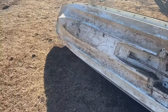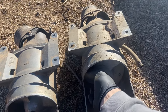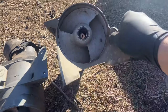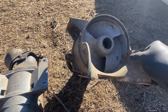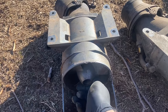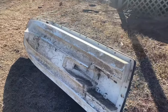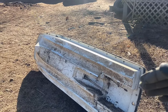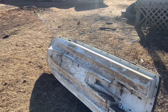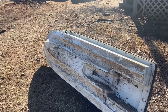We just got the pump pulled, and as you can see, this one is completely locked up. Not really sure what happened — probably got some water under the wear ring and it just swelled up, which is common with these 650 pumps. Thankfully we do have a spare TS650 pump and it should bolt right in, which is super nice. Now we're going to flip it back over, pull the driveshaft out, and start cleaning all the bolts, leaves, and oil out so we can throw the pump back on and then the motor.